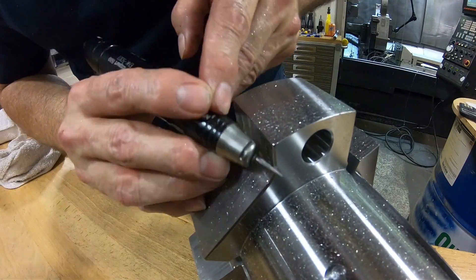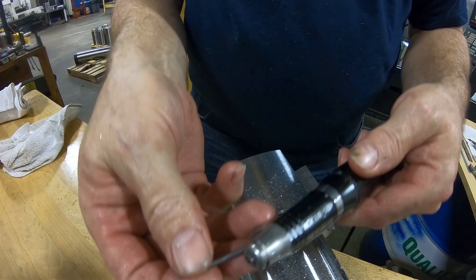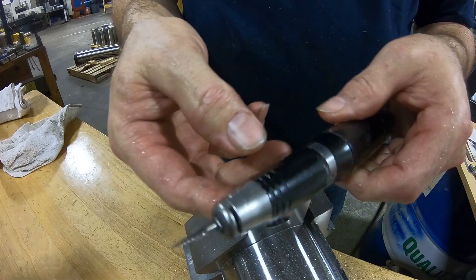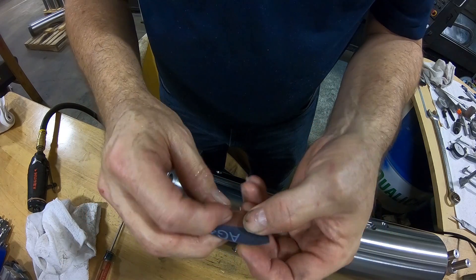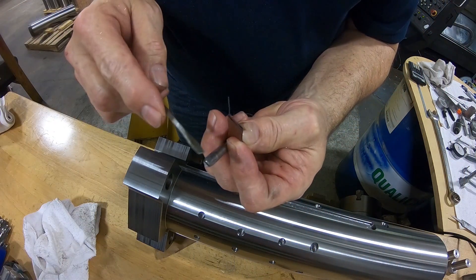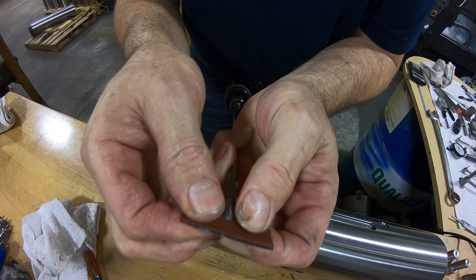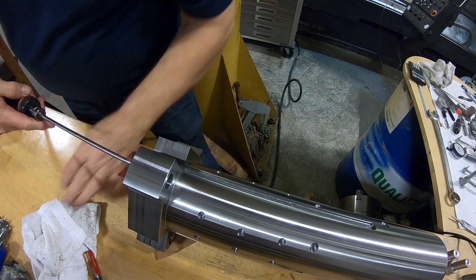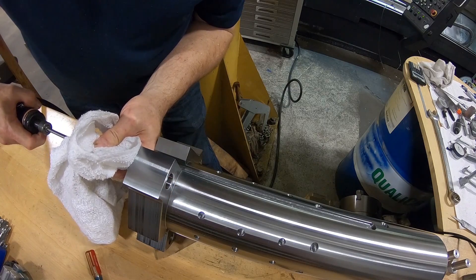I posted some pictures on Instagram showing the bores — I sprayed some bluing in there. I'm just showing here how this grinder works. You don't have to use a wrench to take the burr out; you can just twist the spindle end of that thing and then twist it back and it clamps the burr. Here's the thing I do for deburring quite a bit: I take a piece of inch and a half wide emery and fold it over three times and stick it in the end of this — it's just a rod that I've cut a slot in. Just sort of expand it with a screwdriver and jam this piece of sandpaper in there. This works pretty good for deburring holes and things. You have to hold onto that rod with a rag or you're going to burn your hand with that die grinder, but you can see how the sparks are flying out there. It works really good for deburring like this.